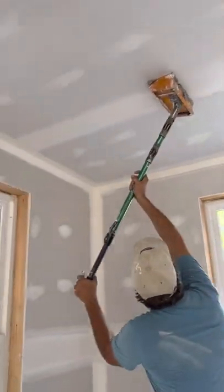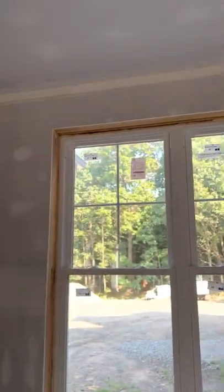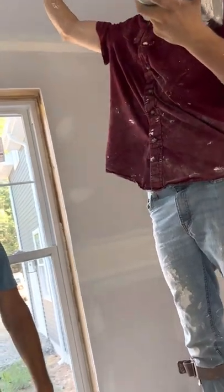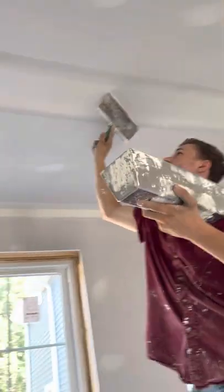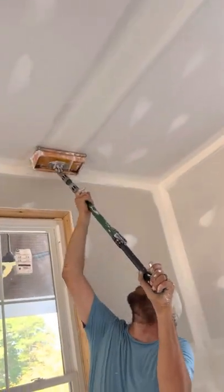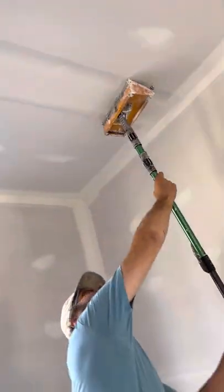There's an example of one that wasn't scraped. You can see the little bump right there if they're not scraped. He's going to have to scrape that a little bit, because what it'll do is create a bump in the flat. I like to do these prior to boxing everything, but in this case we decided to make the video, so I'll run this one one more time. It doesn't take much — at least just a little bit of mud. Everything should be flat.